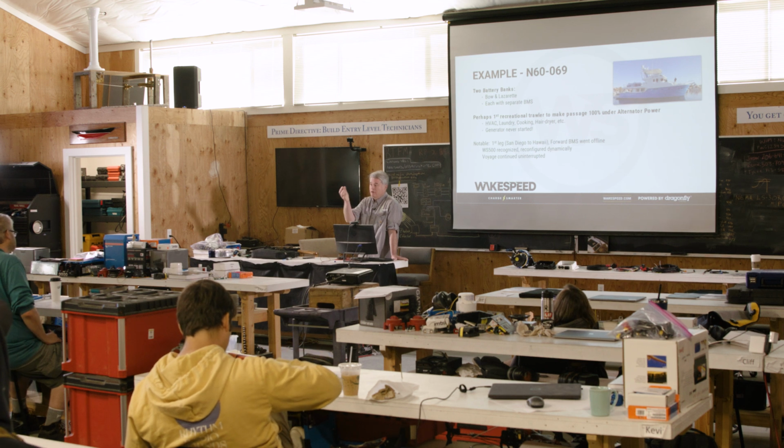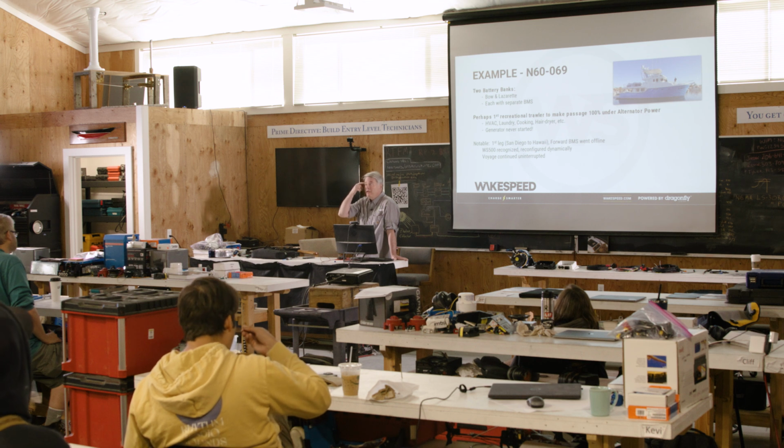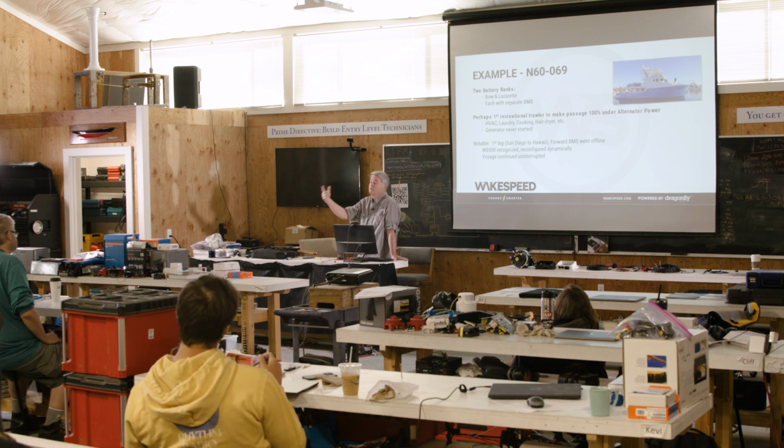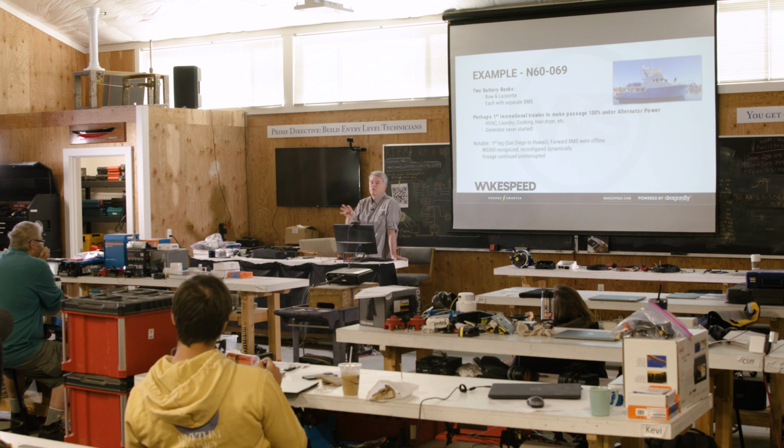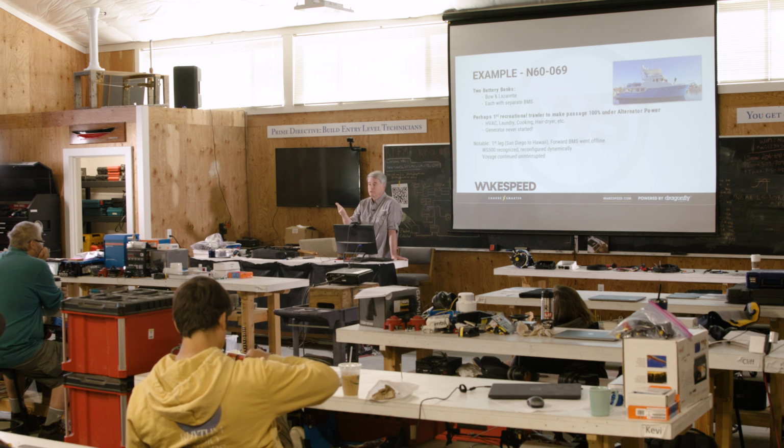Just to cover your question, yes, we are definitely going to go into detail on this. The Wakespeed is different than traditional external alternator regulators in 2 primary ways. There's a number, but the 2 big ones are we're more than a voltage regulator. We actually monitor and manage battery voltage, battery current, we're a current regulator. Alternator temperature, we're a temperature regulator. We can also manage system load.